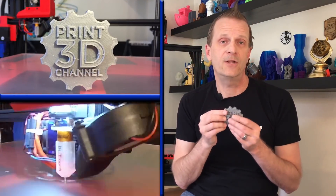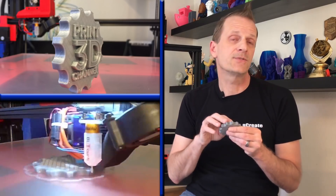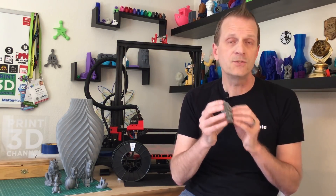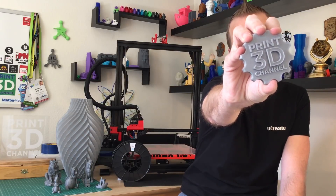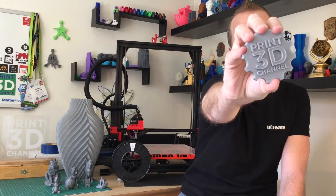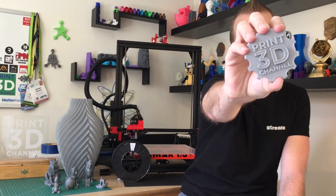After that, we printed out my MakerCoin. I like printing this out in different kinds of filament to really showcase the way the filament prints, because there's a lot of retraction that happens in this print. Because this filament's a little bit brittle, I was a little concerned. But the print turned out perfect with no problems whatsoever. All the little retraction areas and the gap fill feature in Simplify 3D turned out really good. There's a nice even distribution of the glitter flake throughout the print, and the color is very consistent.